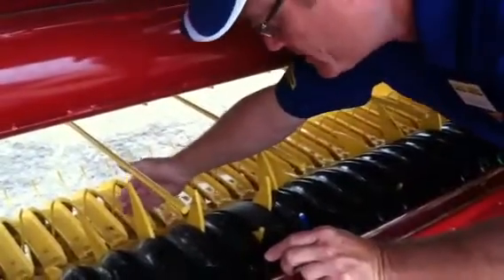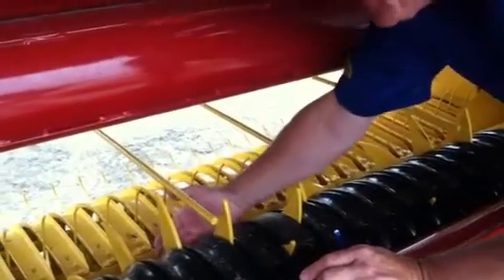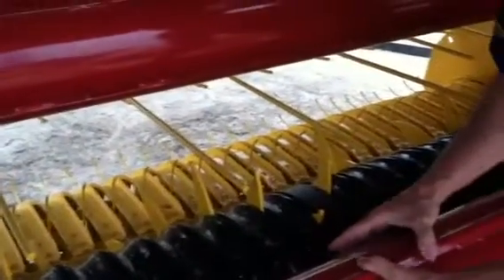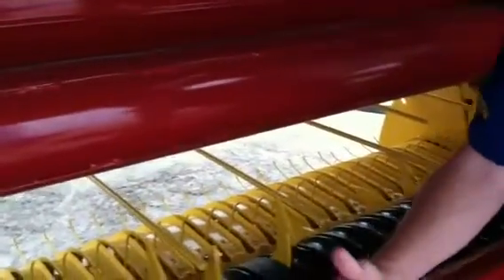These are geometrically placed because it's a low incline — the crop comes in more gradually. It comes across the top here of the pickup, strikes these right about at the center, and the tines are going to bring it back to the steel roll floor where the bale itself rests, and then it goes back to the belts.